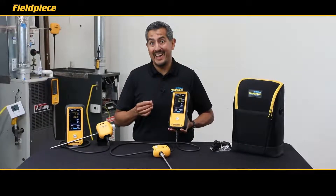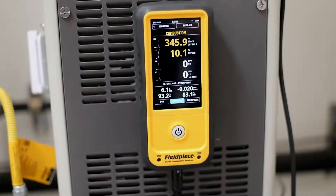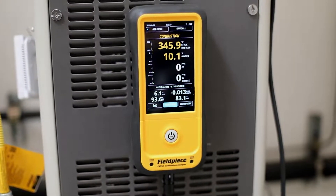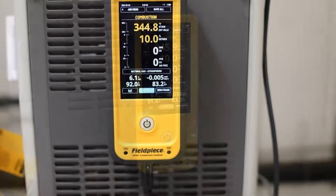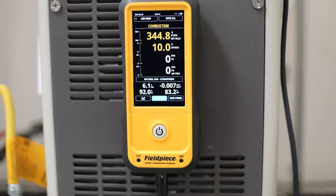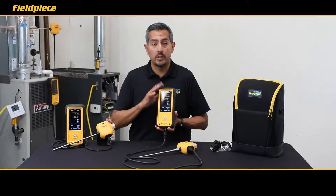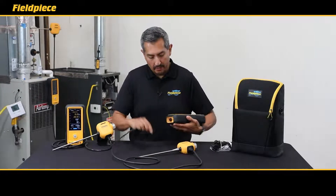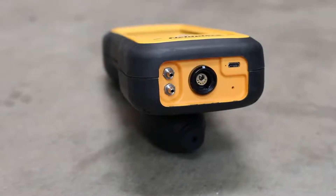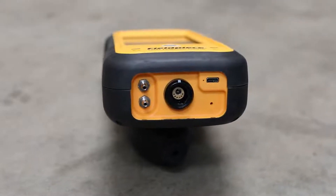Another unique feature of the CAT85 is its ability to measure live draft pressures. You can measure the draft pressure while performing your combustion analysis test, giving you the ability to view in real time any effects on draft pressures based on adjustments being made or commonly vented appliances. On the bottom you also have a built-in dual-port manometer to measure gas pressures, verify correct gas regulator operation, and even measure total external static pressure of the heating appliance.